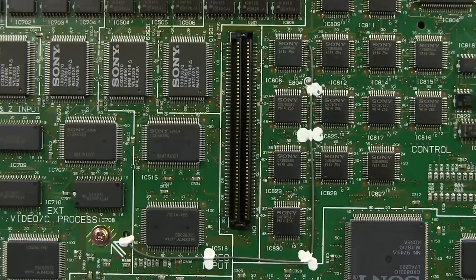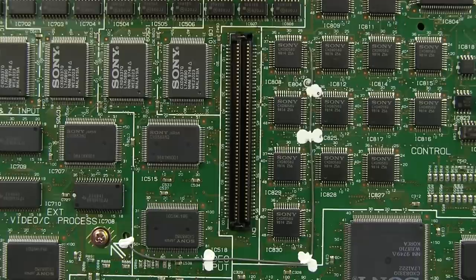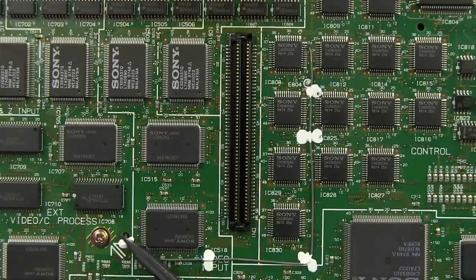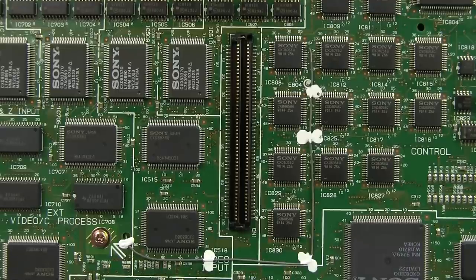But check this out, something that we haven't seen yet on any of the boards is a bodge. But look, we got ourselves a bodge wire nicely tacked down here and here, going from this pin of this chip all the way out down the hole, and presumably there's some via on the bottom of the board for easy access. So they goofed that up. Very surprising at this sort of level, considering the amount of systems engineering that's gone in this to get it right and have so few bodges. Well, it's surprising to even see one at the end of the day.